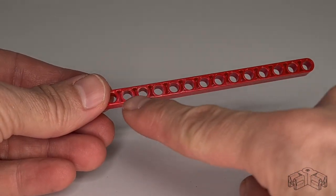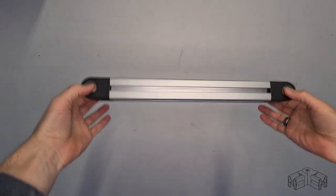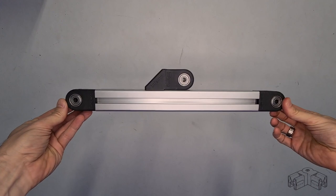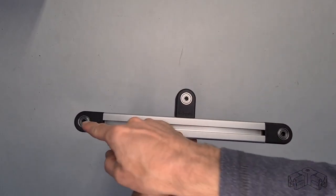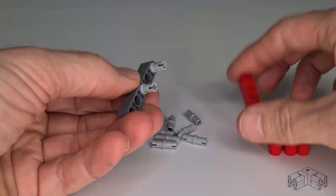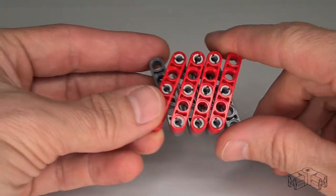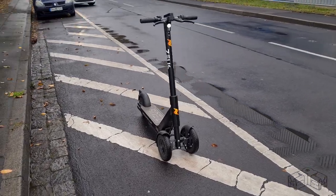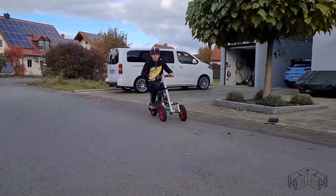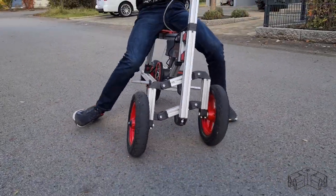A LEGO lift arm has the holes on its centerline. On the ends of an Infento profile this is also possible, but nowhere else. You need to bolt on a bearing block, which means the hinge point is some 40, 50, or even 56 millimeters offset from the centerline. This can be a serious issue for many kinematic builds that require levers. This Piaggio MP3-style tricycle scooter with a pendulum front axle may serve as an example. There is often a way to build around this limitation, but often with a sacrifice in stiffness and compactness.